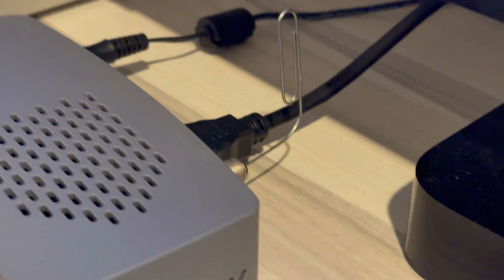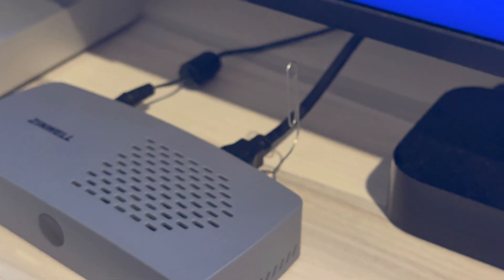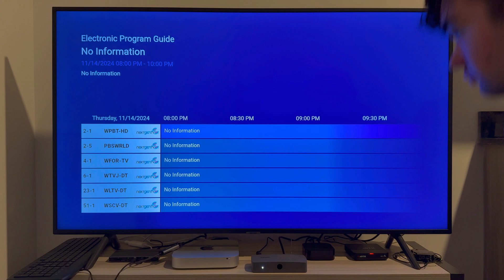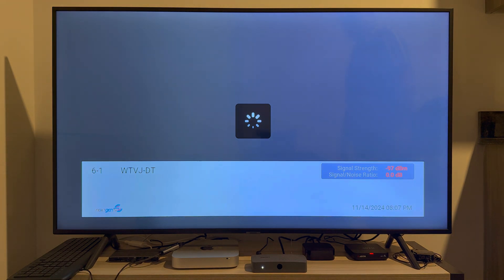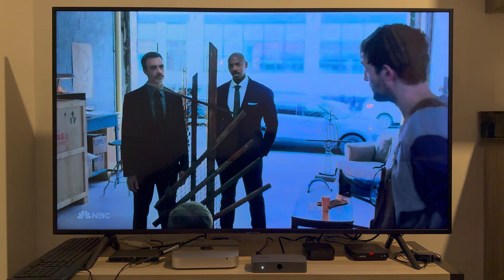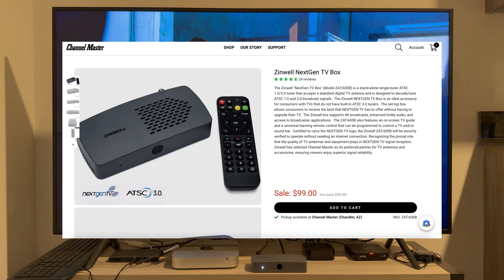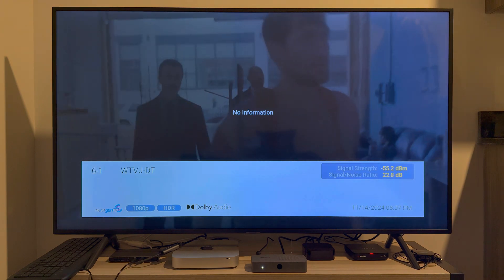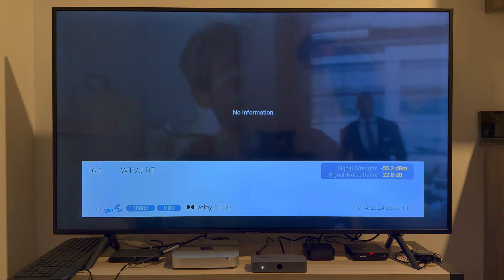So what I'm going to do now is stick in a paperclip that will increase the SNR from around 6 decibels to over 21.5 decibels, which will allow me to receive everything on PLP1. Although all four of the channels that are actually being broadcast over the air have DRM with them, this box handles DRM without an internet connection, so there is no need to connect this to the internet. I can simply have this $99 box plugged in with DC power, an HDMI connection, and a paperclip, and I am able to watch TV channels perfectly fine.